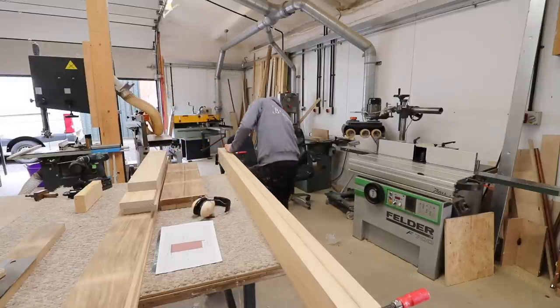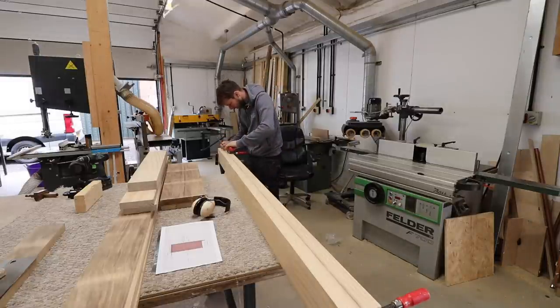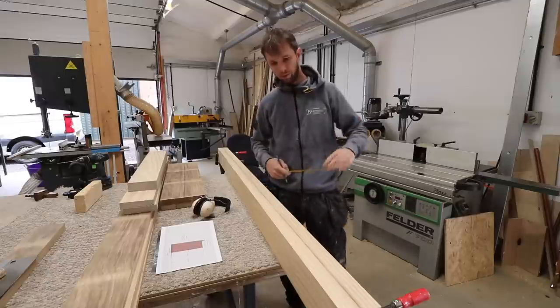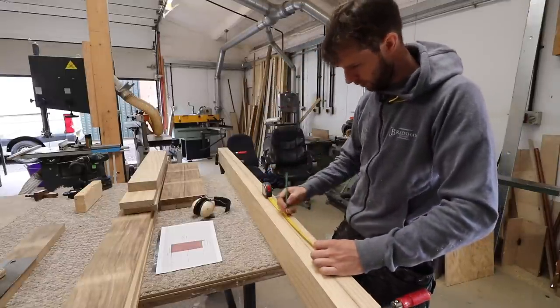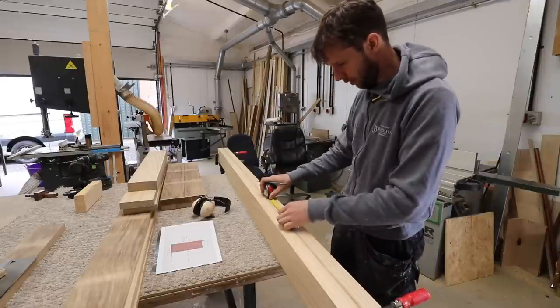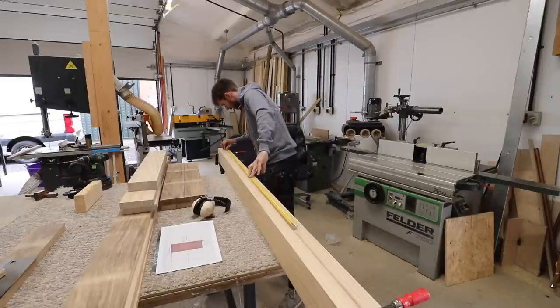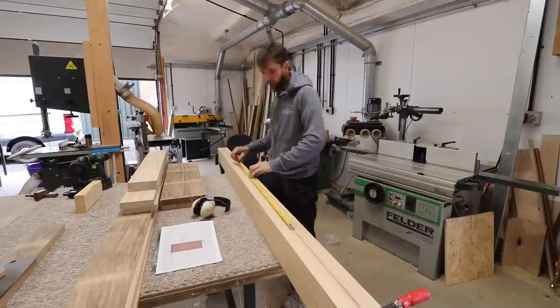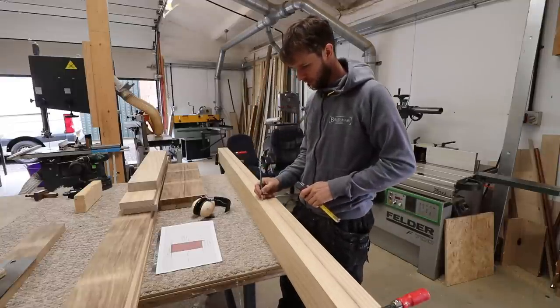the top. In from that mark, and then the middle rail, if we mark it on from either the top or the bottom at that point, and then just measure the gap that's left. So we've got 1455, allowing for the 100mm. And then we divide that by 2.